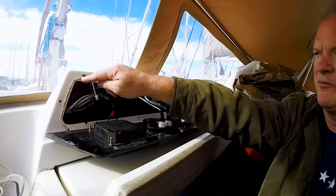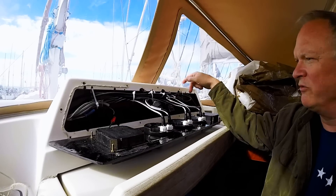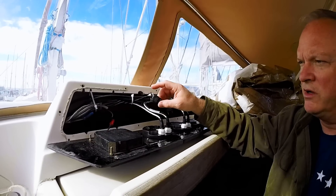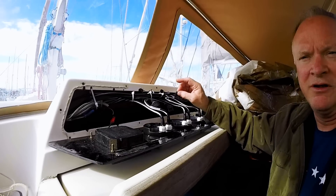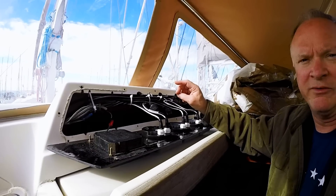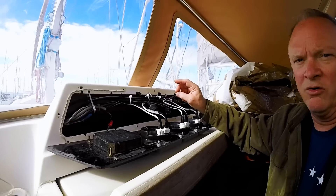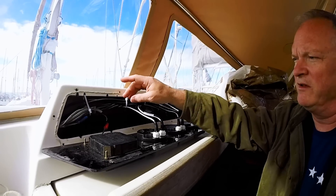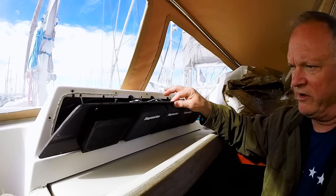What I'm doing here is adding butyl tape to waterproof this instrument panel. In here there's a lot of old wiring, and in normal cases I might be inclined to cut out the old SeaTalk 1 cabling, but you never know when you might need something like that in the future if you really got yourself in trouble — say, a bore or something — and all you had was old style instruments around. We do keep all of our old instruments deep down in the hold in case there's ever a need. But the idea here is I'm actually using it to hold the new cabling, the new SeaTalk spur cables for these new instruments that have been installed.